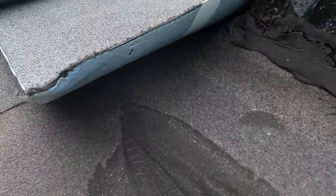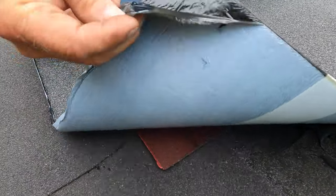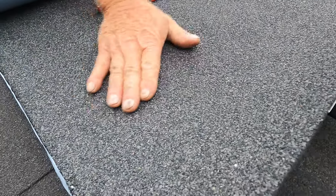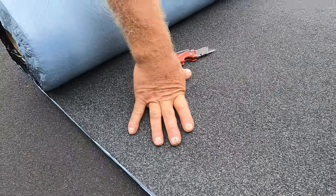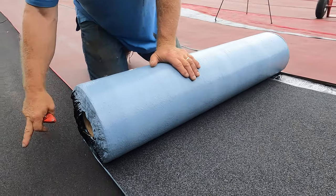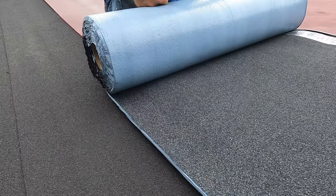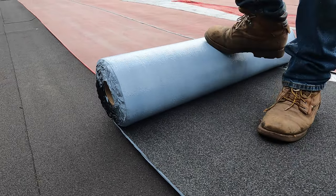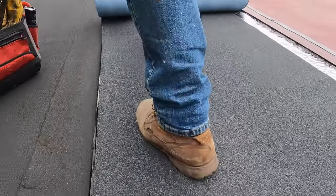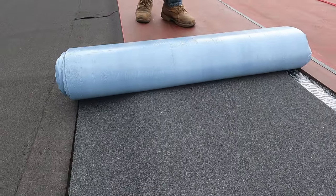That's where the cap sheet will go. The cap sheet is a much thicker membrane and it also has a sticky back — it will adhere to this, unbelievable. It has ceramic granules that protect it from ultraviolet. That's what makes this an unbelievable roof. This is ultraviolet protected — I did this same type 20 years ago, just in a peel-and-stick format now. So you put your cap sheet down. This is the fastest, easiest, cheapest — not much labor involved.